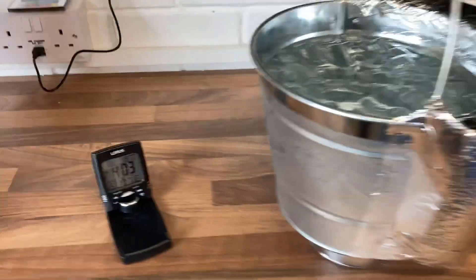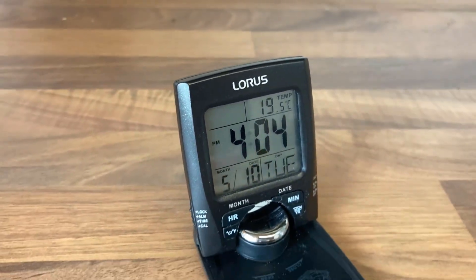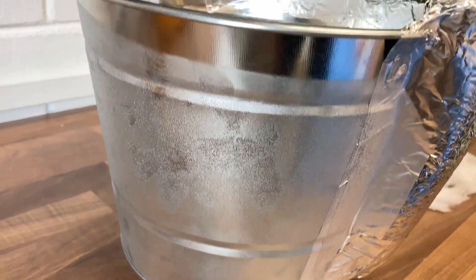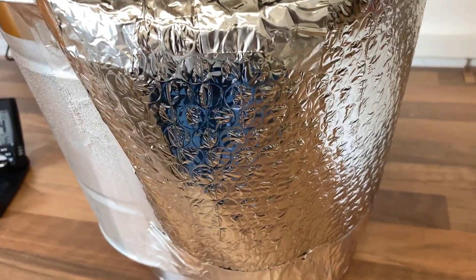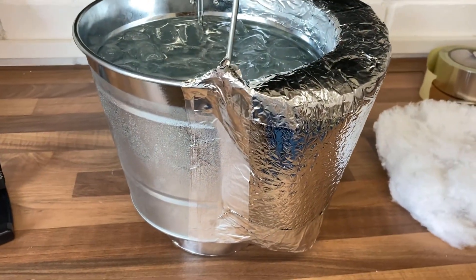A little update — we're just over half an hour in. The temperature has only dropped half a degree, so it's pretty much the same in here, and I can already see a really clear defined moisture line where it's cold. If you look closely, there are already beads of water forming — it's getting really wet. You can see beads of sweat forming there in the right light. On the outside of the insulation, nothing — as expected, since that side is much warmer. The key will be when we cut all that tape and open it up.